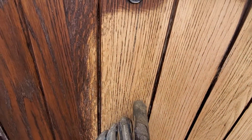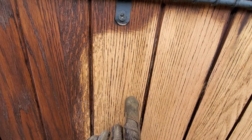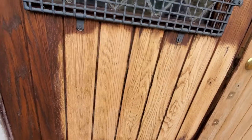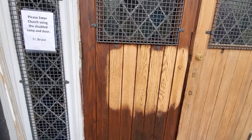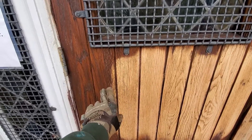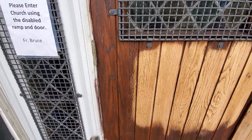There are some spots and I'm still working on it. I'm using 40 grit right now, and then I'll hit it with 60, 80, and then probably 120 — I might skip 60, I don't know. You can see there's a little bit of white left in there, but it's coming off. If you're going to do it, do it right, because this kind of sucks, even though it's working. It's gummed up my pads because this is oil stain that I just put on there yesterday, so it isn't completely dry.